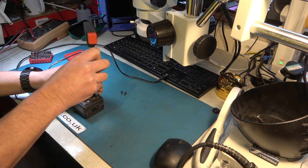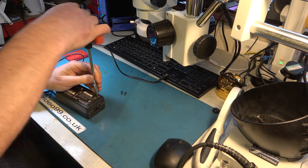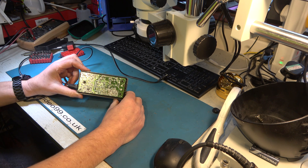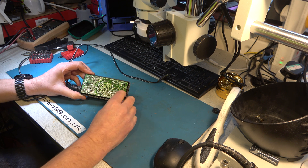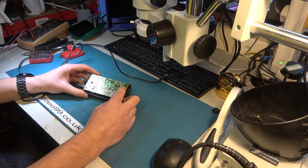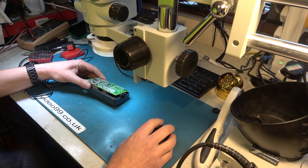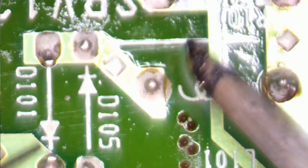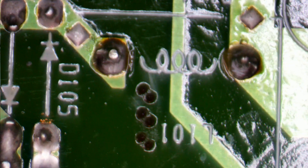And one more, I think. Now, the most common fault I've found on these in the past is the soldering breaks up on the input socket, though I don't think that's the case this time. Let's have a closer look. There are no significant dry joints there. I will re-solder them anyway, just to cover it off. But it looks like today the fault may lie somewhere else. All of the soldering around the input filters and choke and capacitors and stuff all looks a little crystalline, but I'm not seeing any smoking guns for this device having failed.